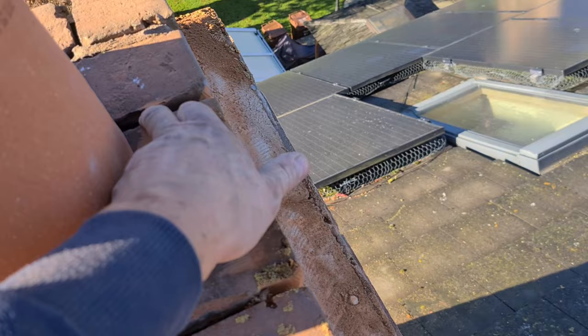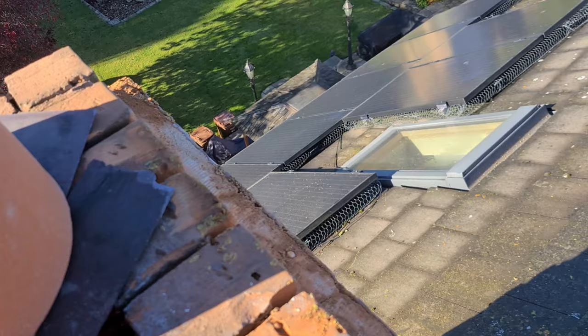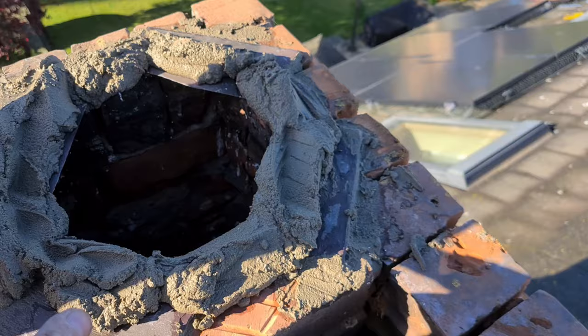The mortar will go into these joints — you can see I've ground them out to get them pointed up. So now I've just bridged a piece of slate across each corner. I'm going to bed this on mortar, because this one has a bit of a drop here, so I need to bed the slate up on a decent bed on this corner to get the pots nice and level. Now we've got the slate in place and a bed of mortar around it for the chimney pot to sit on — that gives it something to bed onto.